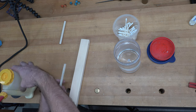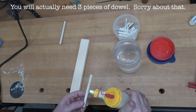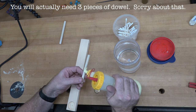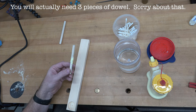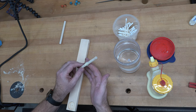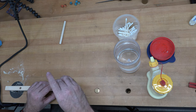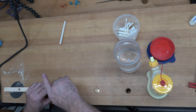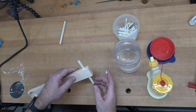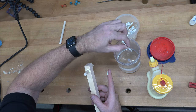The next thing you're going to need is two pieces of dowel that are three-eighths of an inch in diameter and four and a half inches long. We're going to glue them into those holes we just made so they're centered on the board — meaning an inch and a half sticking out on either side. I'll line this up over a bench dog hole and spin it into place. I've got a mark on the dowel at an inch and a half to show me where to stop, and we'll just clean up the squeeze-out.